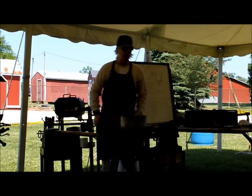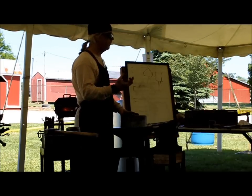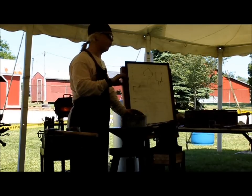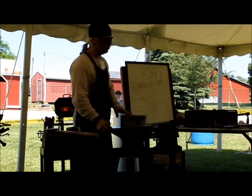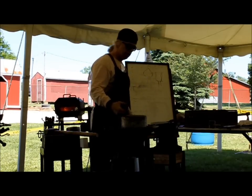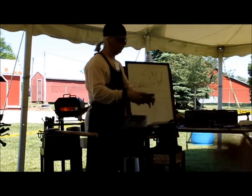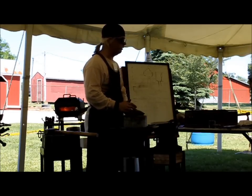So, on the larger frying pan, I took a steel grinding ball and welded it to about a 3-inch diameter round piece of stock, partially forged and partially cut dovetails in it, and I slip it into my large power hammer as the top die. The grinding ball and cylinder bottoms will fit over the framework for the sow block for the base of the hammer.